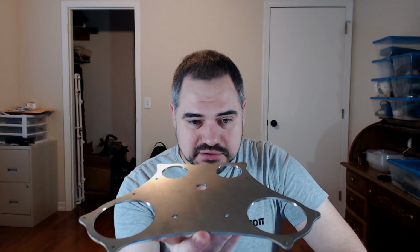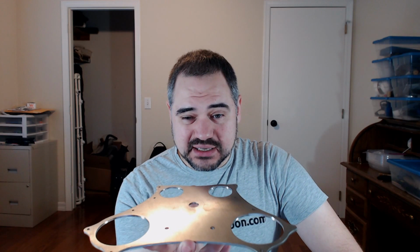The tenons I'm going to machine out of stainless steel pipe. And while I got 9 out of the 10 pieces of pipe I needed just fine, the 10th piece turned out to be difficult. I had to order it twice, and they kept sending me the wrong one. I needed Schedule 80 2.5-inch nominal pipe, and they kept sending me Schedule 40, which the ID is too big for the tenon I needed to make. So this week, I did finally get the correct piece.